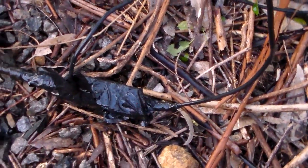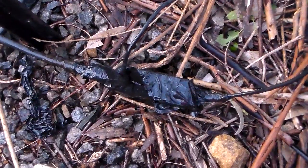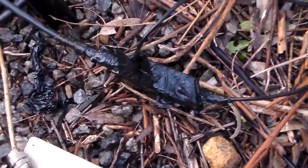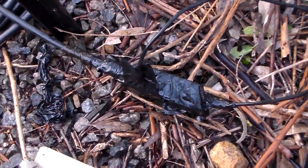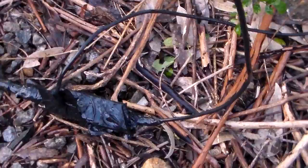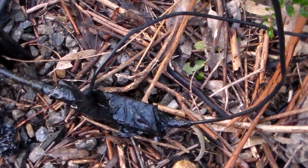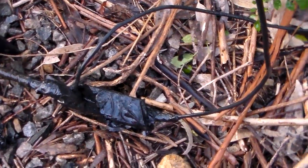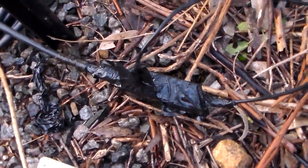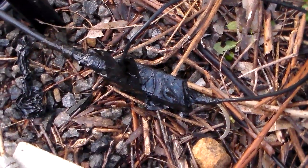And once it's all sorted out, the banana plugs will come off, and these two wires will be connected to whatever matching arrangement I end up with — whether that's an autotuner or whether it's an ABS box with just basically an L match for the band I'm interested in. I've got an adjustable L match, and I was thinking of putting that on for 40 metres, just connecting it to these two wires, matching it to 50 ohms on 40 metres, measuring the inductance and capacitance values, and putting in a fixed capacitor and inductor — and then the same for maybe 20 metres, and then basically just connecting them in parallel, and hoping that the RF would flow down the path it liked best, and that the impedance of the other parallel circuits would be so far out that it just wouldn't see them.